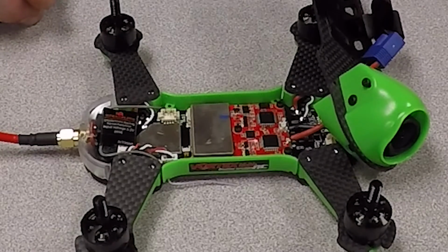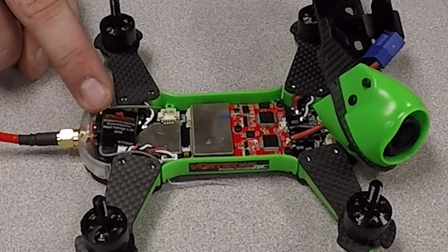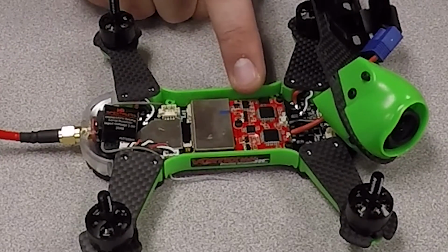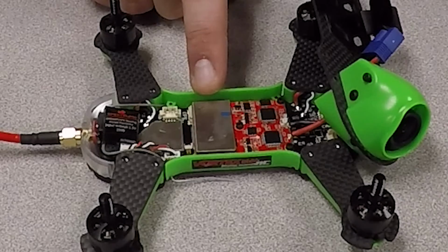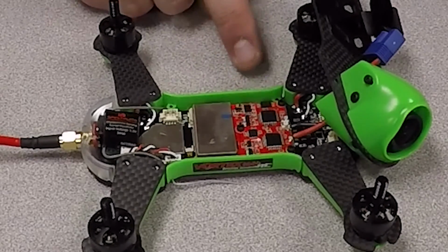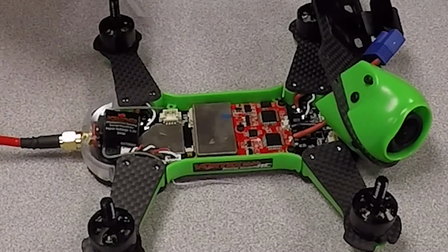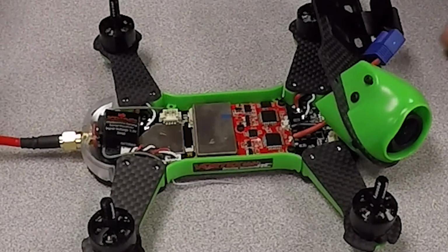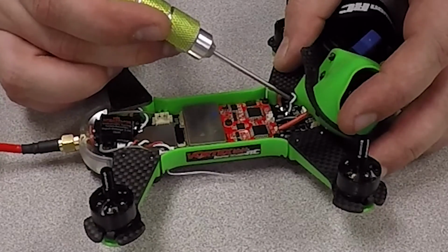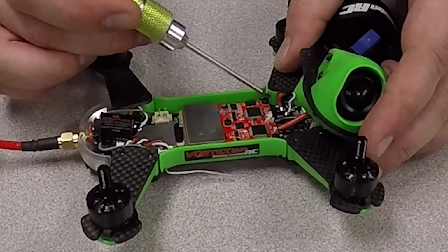And now with the top plate off, you can see our Spektrum serial race receiver with auto bind here, our Synergy flight controller, and Tramp variable power video transmitter all in one right here. So the arms, the ESCs are actually in the arm, and you can see the 3 wires for each electronic speed controller here mounted to the PDB or the bottom plate.